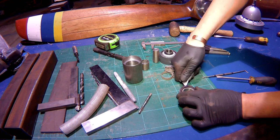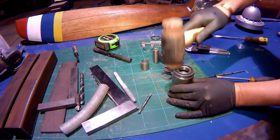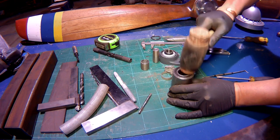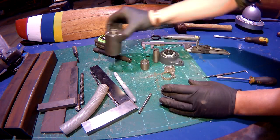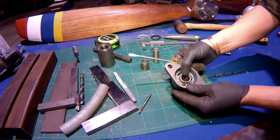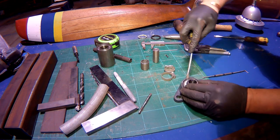Because the motor is only 60 or 70 watts, I'm just removing the rubber seals from the two bearings, because even these rubber seals will add additional friction and resistance that we just can't afford. It would likely give the motor a real hard time and will probably cause it to fail in the future. So I think it's really worth doing — and looking back, I probably should have cleaned all the grease out as well.